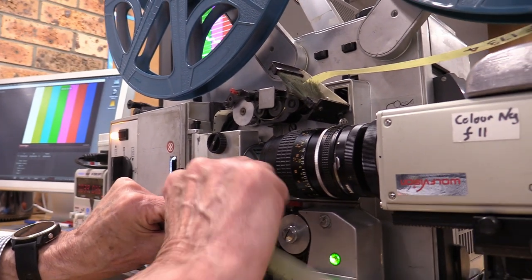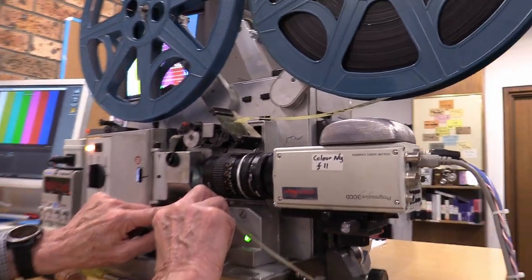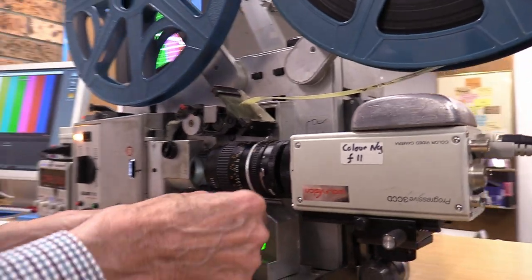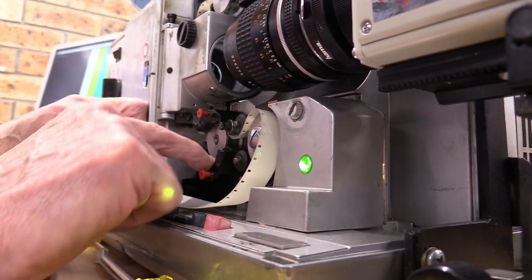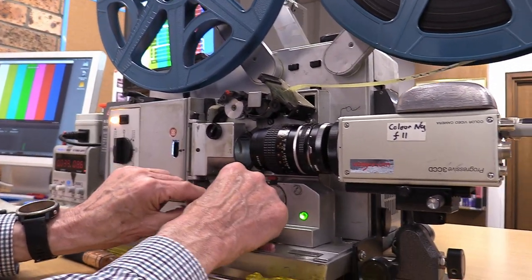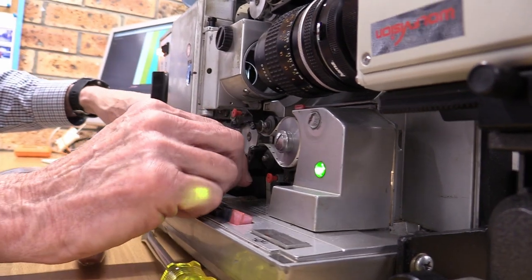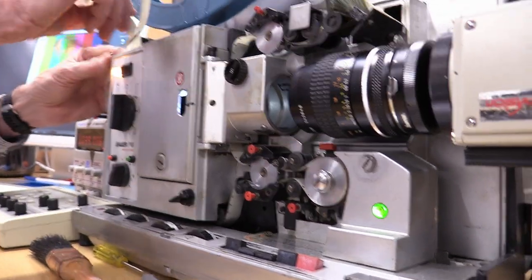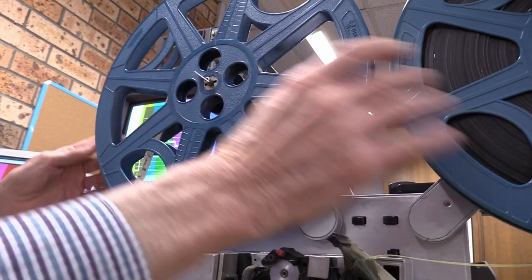Then we can open the bottom sprocket pathway and put the film onto the bottom sprockets so that it's above the black line and the top of the black line below the gate. Then we can wind it around the sound drum. We need to pull down both the sprocket lock and the lock on the other little roller there — his name escapes me at the moment. Now we put that through, hooked over the sprocket. We can release this, which creates tension around the roller, and feed it back up through here and onto our take-up reel, and then we have the whole thing going.